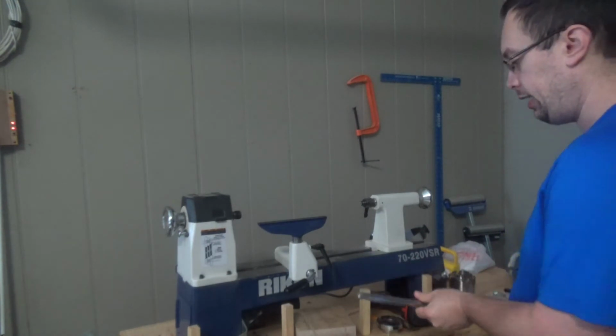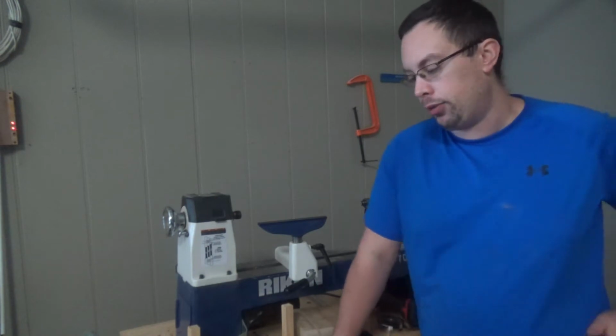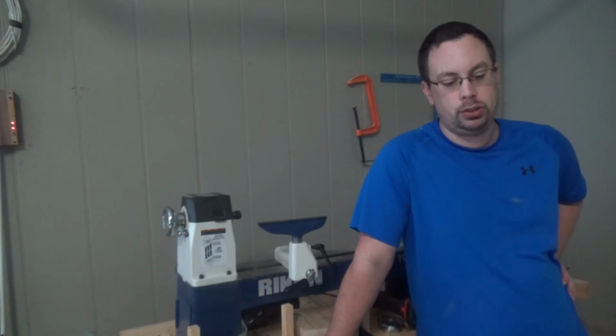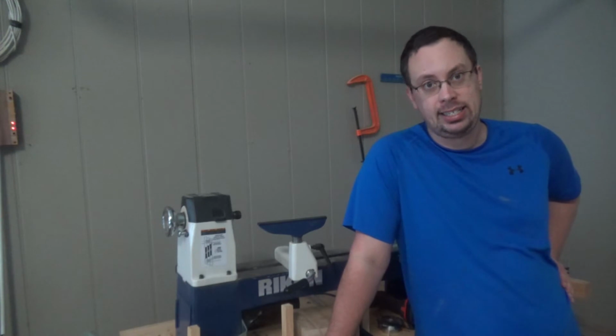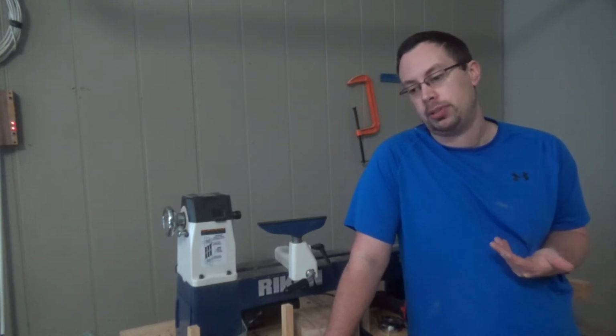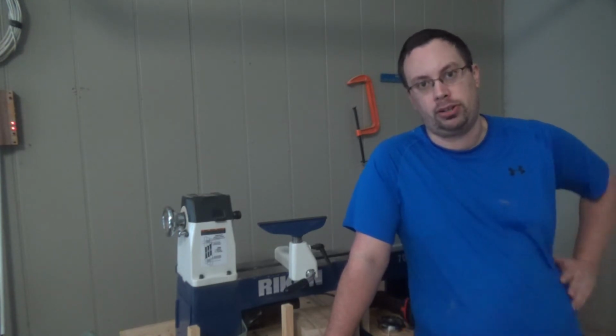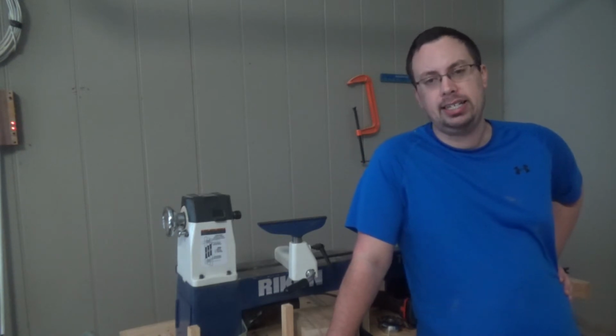Now, like I said, these are more beginner friendly. I've heard of other people swearing by the traditional tools, which there's a whole variety of. They're pretty much high-speed steel, which is a special type of steel which helps it to stand up to the forces on the lathe. But there are the basic tools in high-speed steel. We've got, to my knowledge, five different ones. If I forget one, I'll bring it up.